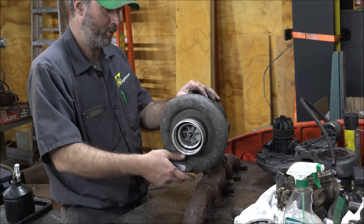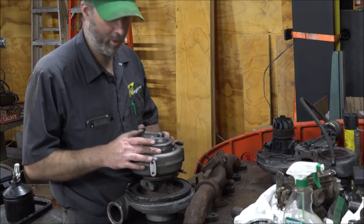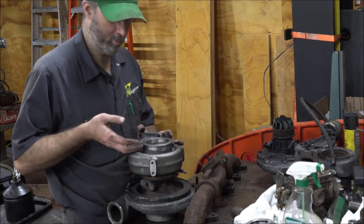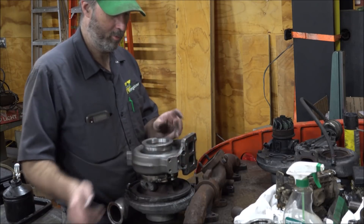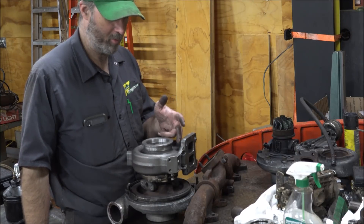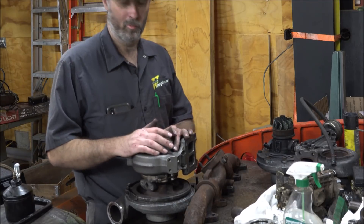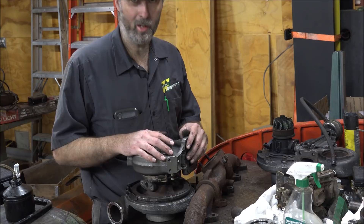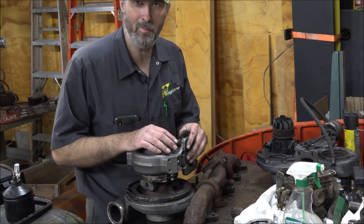Yeah, all kinds of room this way too. I hope you enjoyed getting to see that stunt machining to turn this groove basically around here, because there's limited clearance in here for a boring bar tool, especially one with an offset that could go around this corner. But the woodruff cutter did the job — making use of the tools you have at hand. Thanks for watching, thanks for subscribing, I'll catch y'all later.